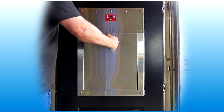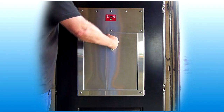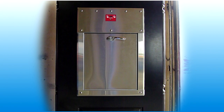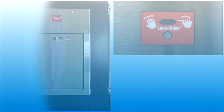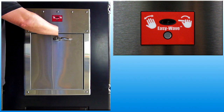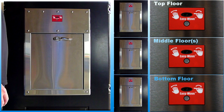Doors are equipped with a tamper protection system to lock out a door receiving too many instructions. If the motion sensor is activated over 4 times within a 90-second period, tamper lockout is activated. The interface panel will not respond to any input and the chute door will remain locked. In this mode, the indicator light flashes red 1 time with each user input. The door will not return to normal operation until it has been left inactive for 90 seconds. Lockout only affects the door being tampered with. All other doors on the chute function normally.